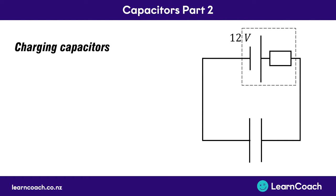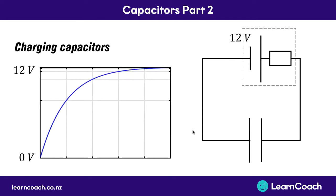Now last time we learned about capacitors charging - what happened is that a battery might go through a resistor and puts a whole lot of charge on these plates, both positive and negative, and that builds up over time. So if we looked at that in a graph, the voltage on the capacitor would start building up really quickly, and the reason is that there's nothing opposing the charge to start with. So quite a lot of charge in this first little instant is going to get pushed around and stored on the plate. We're going to break this charging up into time periods which we call a time constant. After one time period, 63% of the charge is going to go on, which is quite a lot, and that's because there's no repulsive force to start with so it starts charging really quickly. But once you've got to this level you've already got some positive charges building up on the positive plate and some negative charges on the negative plate, so now that's going to repel and slow the charging down.